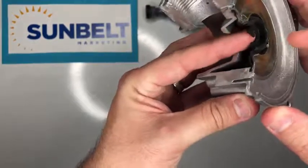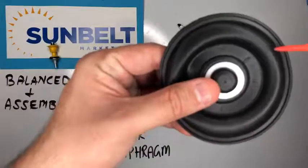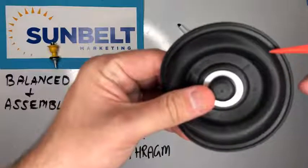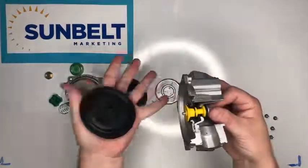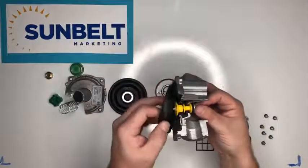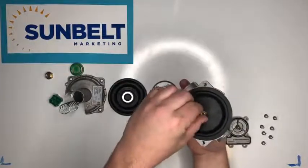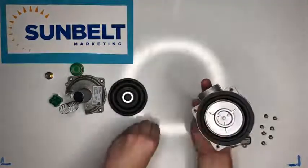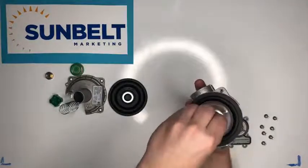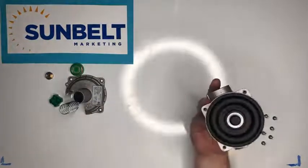Here's a closer look at the balanced shutter diaphragm and the pinhole, which is part of the integral vent limiter. Here's how all these diaphragms fit together: the balanced shutter and yellow piston connect first to the worker diaphragm. That worker diaphragm is protected by a small plate, and then we connect the safety diaphragm, which has the pinhole.